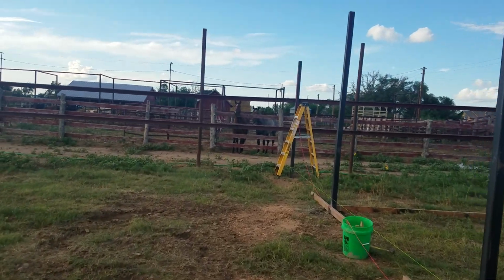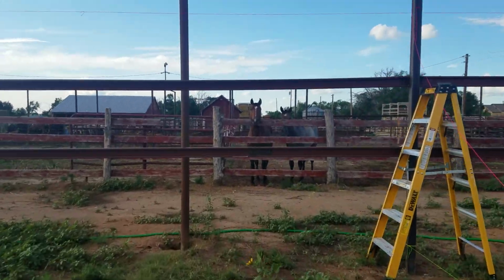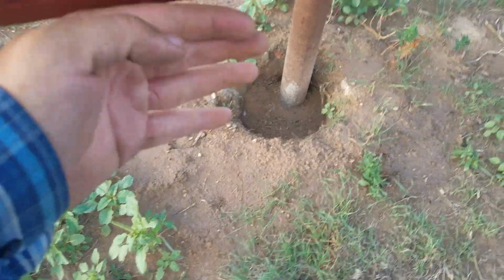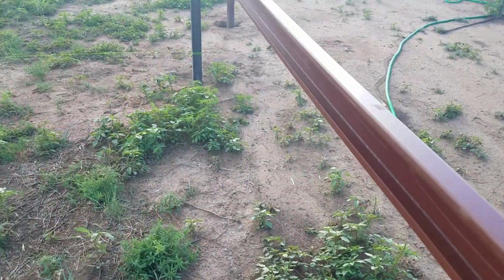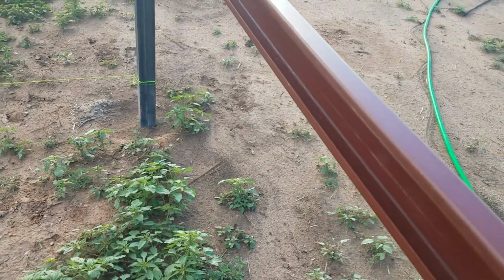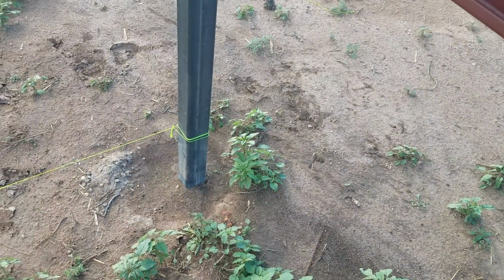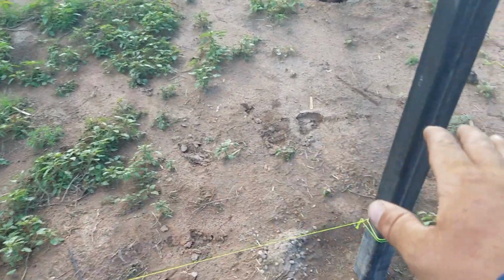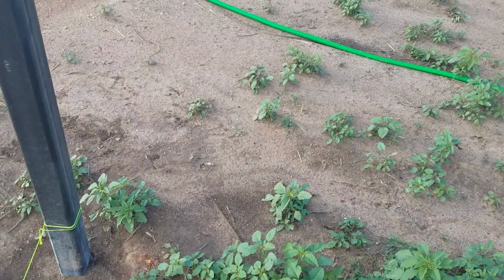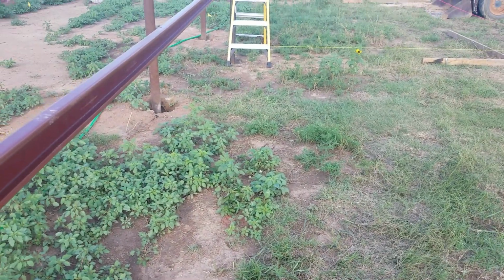It's not a true stem wall because we're not going in the ground very deep. We will clear a little spot and just run some rebar through it. But really, all it is, we're gonna run a wall here, and our tin is going to go down one side of it about 5 inches. We'll have a piece of angle iron on the top to screw to. And the wall is going to be like 18 inches tall. That way, as we're cleaning this barn out, if we hit the wall, it stops the skid steer and we don't push our tin out. Because sometimes you get a little wound up in the skid steer.